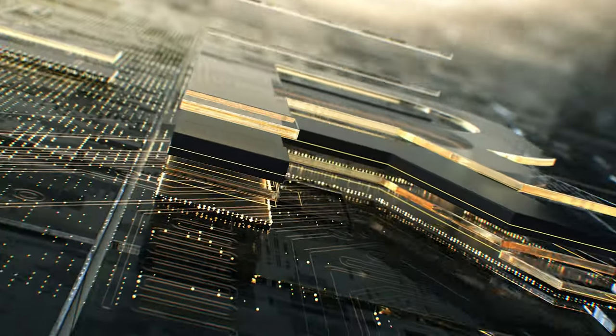So basically what we're going to do is start with our USB to UART converter, use that COM port connection to translate into a UART connection, send that out over an Ethernet cable, and to do that we're going to add a line driver to that project. We're going to create a little module that we can plug into our computer over a USB connection. The output will be an RJ45 connector that connects to an Ethernet cable, and then that cable is going to plug into the switch we'll show in an upcoming video. We'll be able to do all of our configuration and initial board bring-up through that UART port.